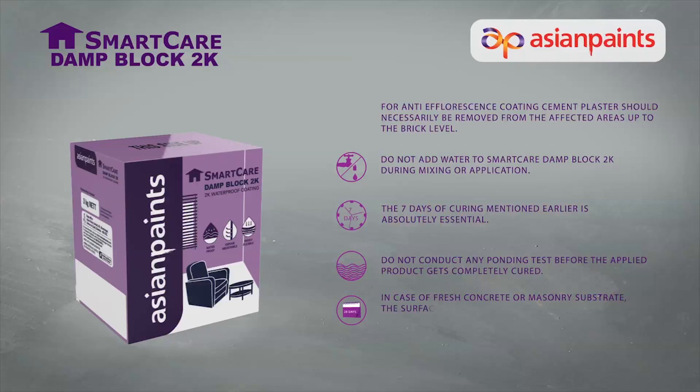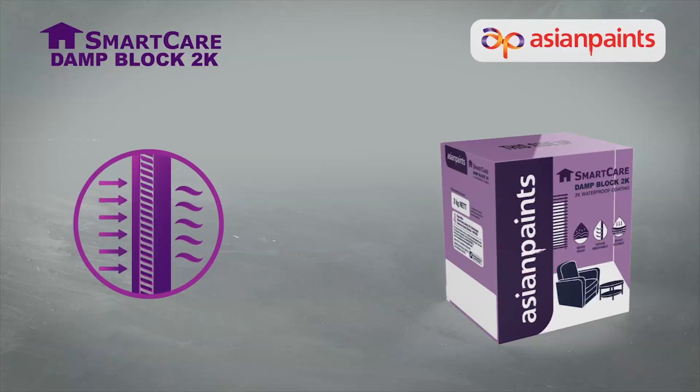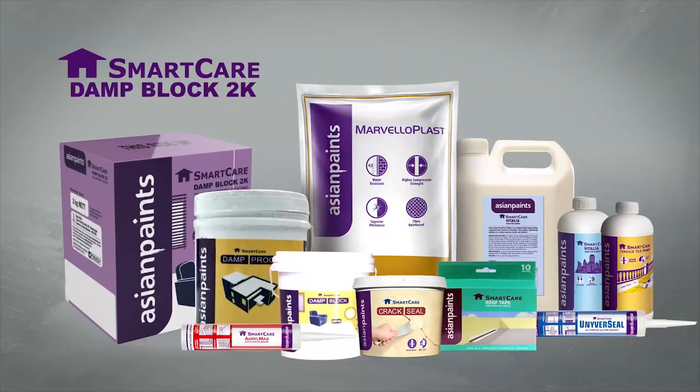In case of fresh concrete or masonry substrate, the surface must be cured for 28 days before application. Overlaying of cementitious screed or plaster must be done within 24 to 48 hours of application. Thus, with its superior positive and negative side waterproofing properties, SmartCare Damp Block 2K is yet another valuable addition to the ever-evolving Asian Paint SmartCare range.